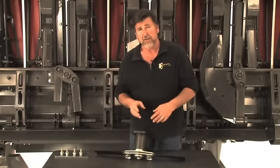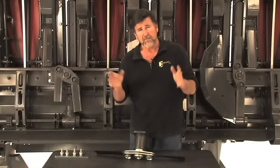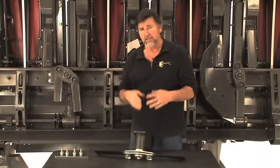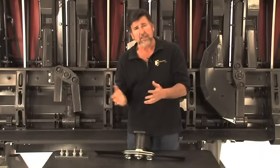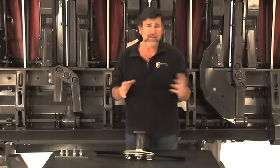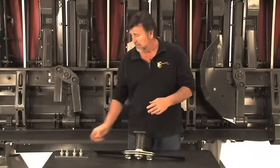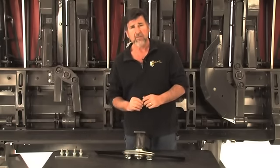Here at Drago Tech USA, we're very proud of the Drago Corn-head's ability to offer a lot of flexibility in residue sizing, starting with a great knife roller head to chew up the corn stalks, and being able to add the chopper later. You can buy the head with or without the chopper from the factory. If you want to add it later, it's just simply 4 bolts, remove a plate, 4 bolts, add the chopper.